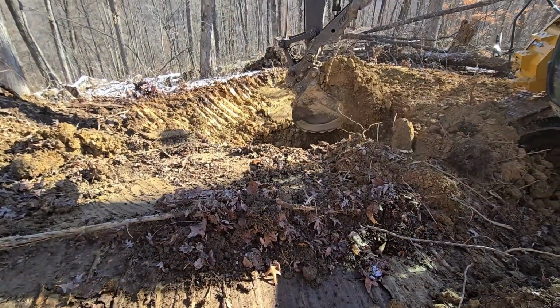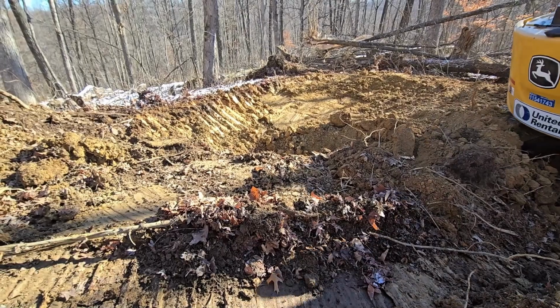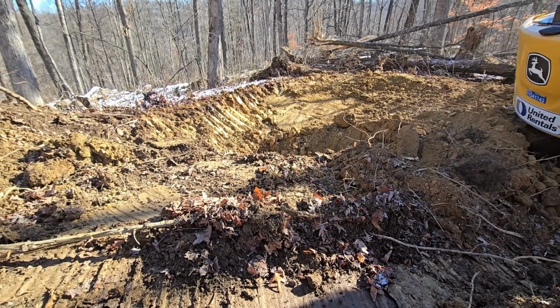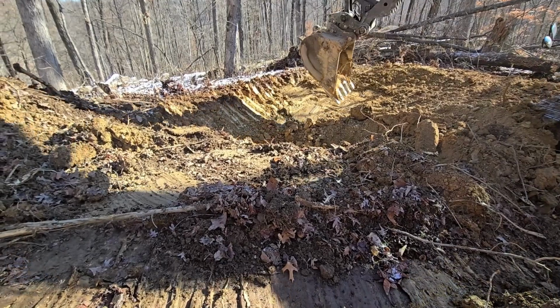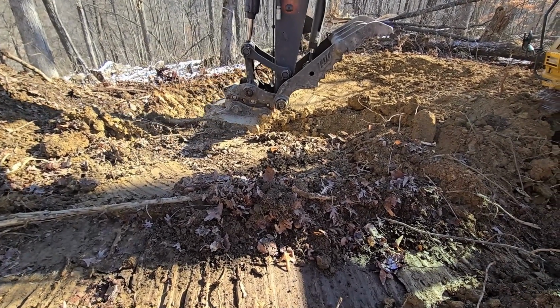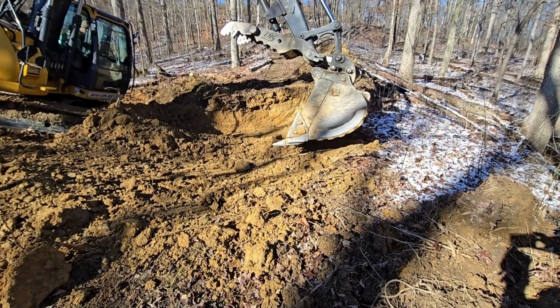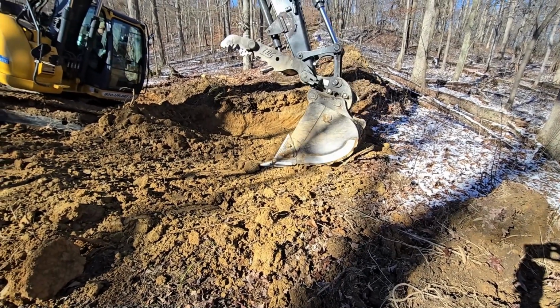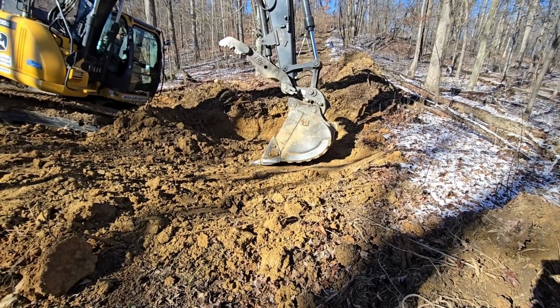We continue to remove soil from within the wetland being built to create a basin that is deepest in the middle. The basin is dug 4.5 feet deep in the middle, so we may add 2 feet of compacted soil and 6 inches of topsoil to produce a wetland that is 1 foot deep in the middle. After soil has been removed from the center and uphill edge of the wetland being built, the excavator operator continues digging the trench with a vertical wall around the marked perimeter.